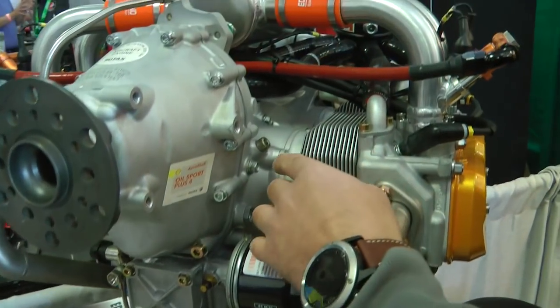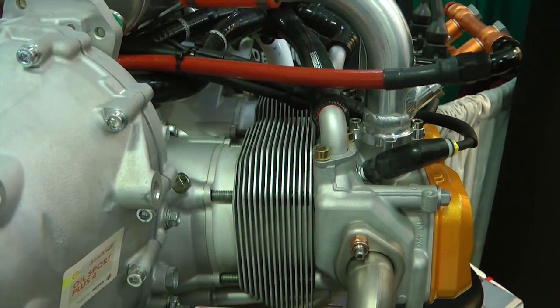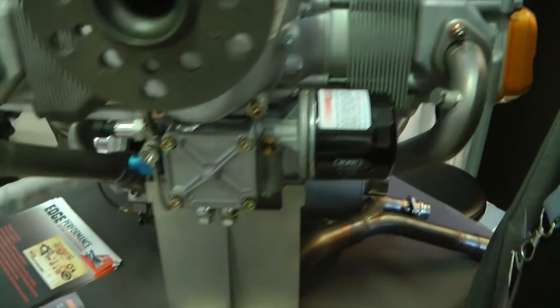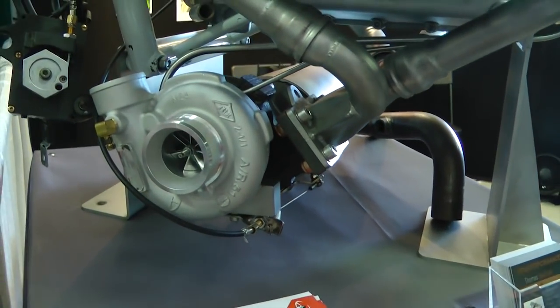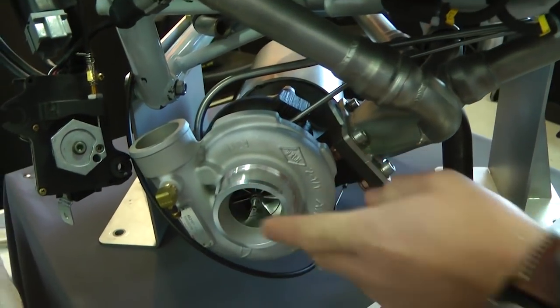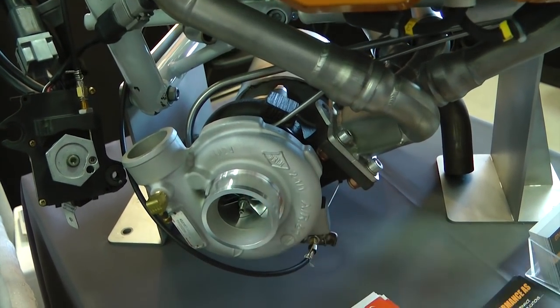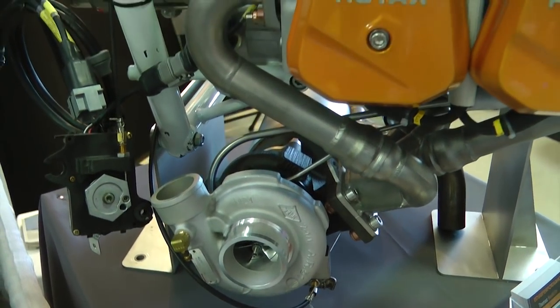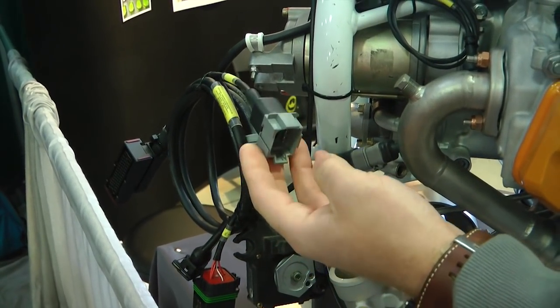As you can also see, we do some big bore kits. We make our own cylinders with a bigger displacement. And we also now do a turbo kit. You can see we make our own turbo exhaust, but it uses the same location as the Rotax 914 to accommodate for most airframes. We use the Garrett turbocharger, which we modify. We have our own billet machined compressor wheels to get better performance at high altitude. And we make our own wiring harnesses — made by MilSpec, all pre-wired. They have their own serial and batch numbers for full traceability, making installation simple.